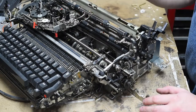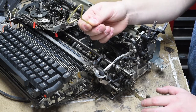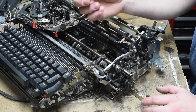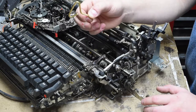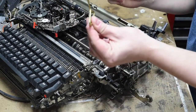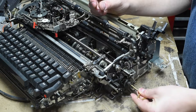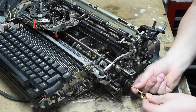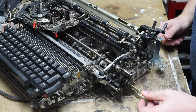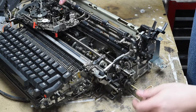So what do you do? I have a 1/8-inch piece of brass here — I bent it into shape. You can buy these at Home Depot for a couple of bucks; I had pieces left over from making a radio antenna years ago, so I just cut a piece and made my own tool. It doesn't thread fully in but it goes in and locks in place. You have to turn it the wrong way — counterclockwise — and once it's in you can advance the mechanism.